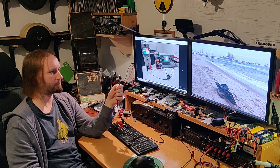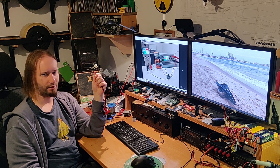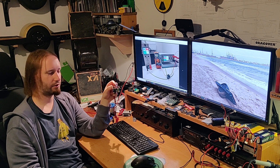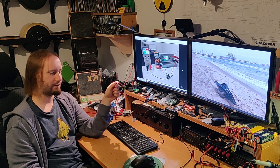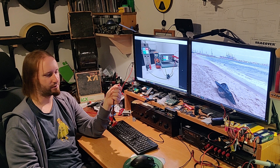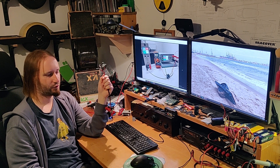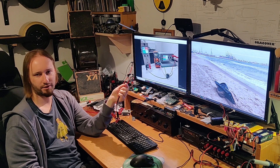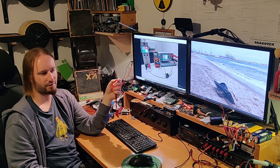What's the conclusion? I think this is not a bad product, at least not for its cheap price. It's true it doesn't work as specified all the way to 120V, but I'm building a 20S OneWheel with 84V maximum voltage, and braking spikes really shouldn't go above 100V. All you need to consider is not using it above 110V. If you load it at a constant 3A it's going to heat up a little bit, but not that bad. Despite the fact that I blew this thing up, I think it works just fine and I'm going to use it in my project. I hope this was helpful — see you next time.